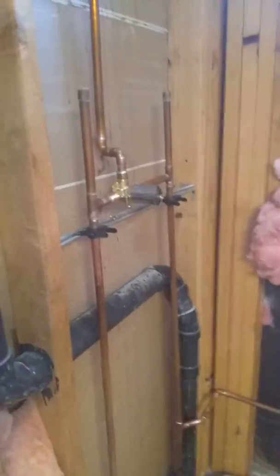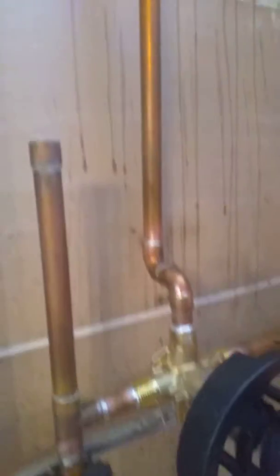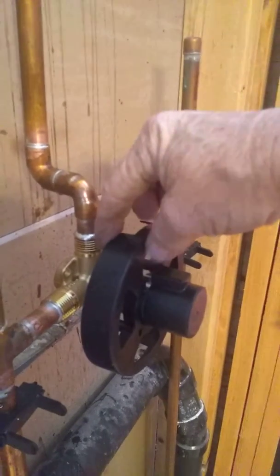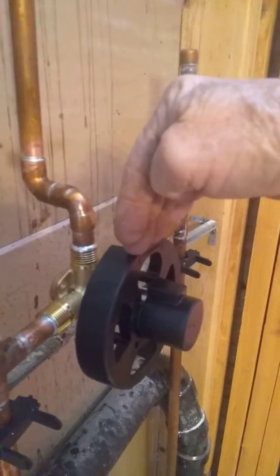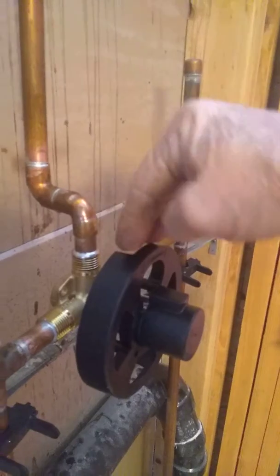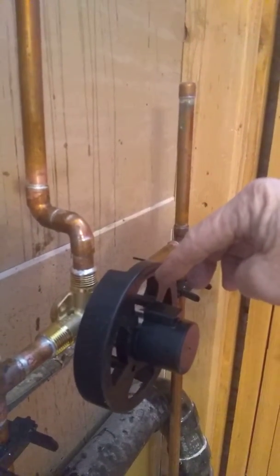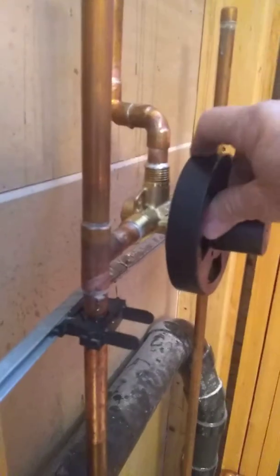Every valve has one of these guys. This is to determine the thickness of the wall. So basically on this Moen that we replaced that old Delta with, this is the area where the wall needs to land. So when they build the tile out or whatever they do, they might be able to get away with a quarter inch past this as far as wall thickness goes. And that would be from the face of the stud. They have about an inch and a half.